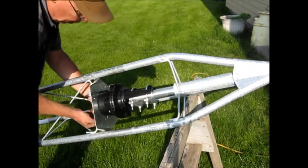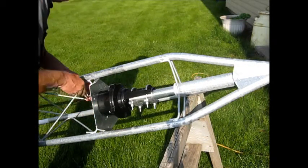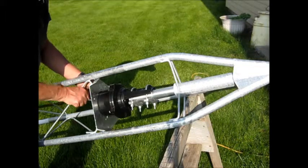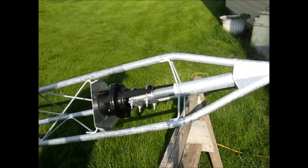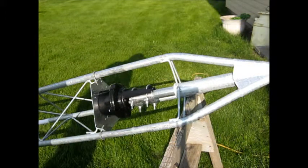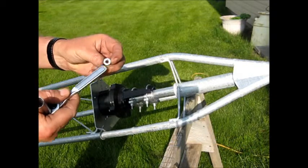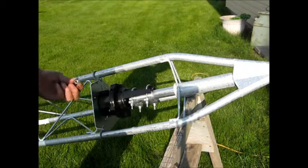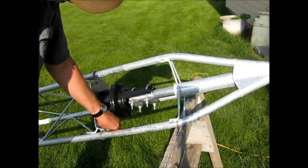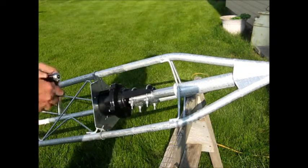This is just a dry fit — we'll be taking it all apart, painting the base of that plate and the holes with galvanized paint. I'm going to put the last nut on the last U-bolt. These nuts have been swaged a little bit on each end, which compresses the first thread and acts like a lock washer. So you've got to put it on the correct way where the locking part is to the outside, and for that reason you can't screw it on all the way with your finger — you've got to use a wrench.